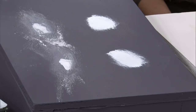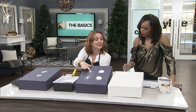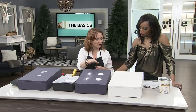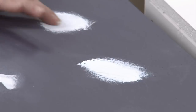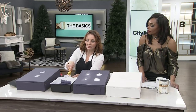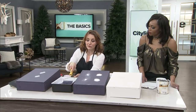You want to take the dust off — not with your paintbrush usually, but we'll do that right now on TV. You want to have the dust off, then possibly even clean it. It's much smoother — you can still see it, but you can't feel it. Then it's important to spot prime. Over here I used Benjamin Moore's Fresh Start — I just love that primer for everything. I did that over the patches because the putty is a different porosity than your wall. Whether you're going to use a brush — if it's just a small hole, you might just use a brush rather than a roller.